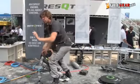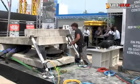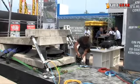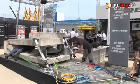So there we go — we have a pushing force of 10 tons. I'm all the way down, putting it in position, pushing it against my object, and it's stuck right away. Now I can give a little more force on the strut by turning its collar — so now it's tight. Of course we can also use it from a safe distance.